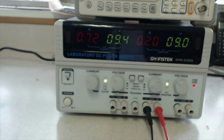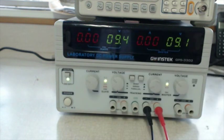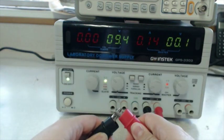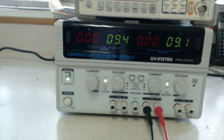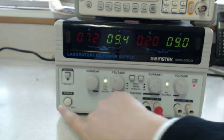Next up, I am going to show you what will happen if a short circuit were to occur by touching the two leads together. You should be able to hear the clicking of the relays inside and see the voltage drop to zero, indicating a short circuit. This then concludes our video on the DC power supply. If you have any further questions, please do not hesitate to ask Ademi or one of the lecturers. Thank you.